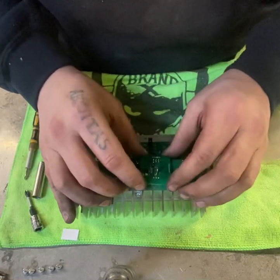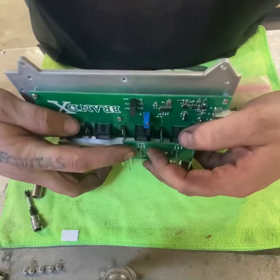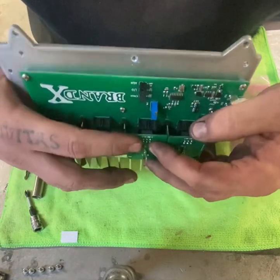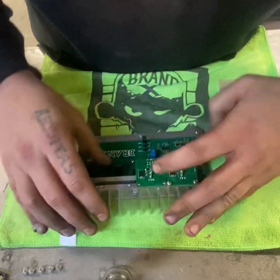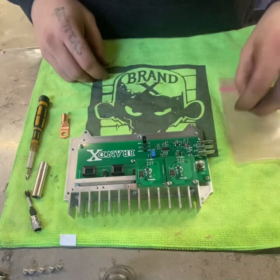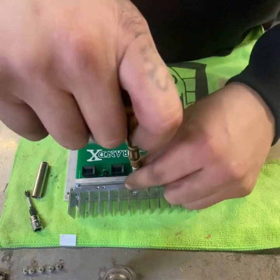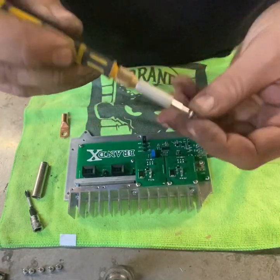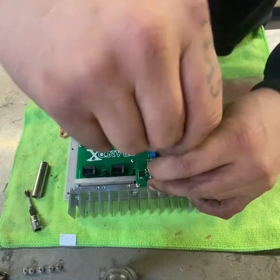You'll take the tape off, slide the pad into place, and as you can see in the video, I'm going to have the pins lined up with each other. You'll push those pins in, and then the field module will come with two number one screws, and those are for securing the MOSFET and field module assembly to the heatsink.